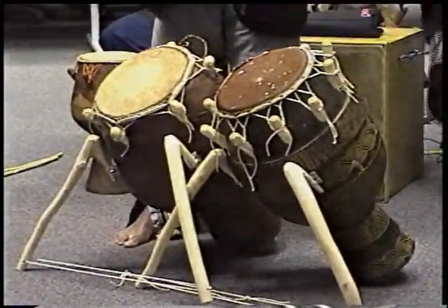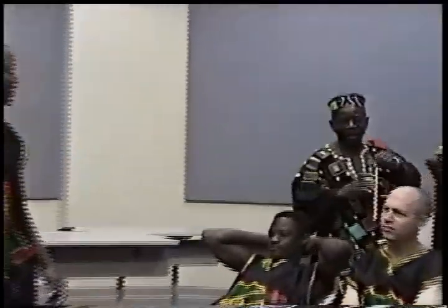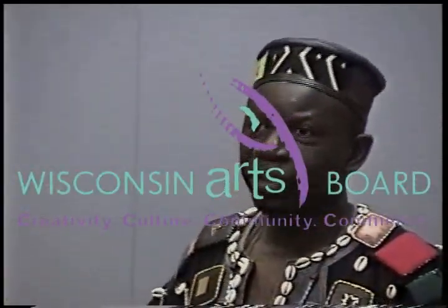This one is really round. When I'm carving them, I use green logs. So first, when I finish getting the shape I want, I use recycled newspapers, wrap it round, and then put it in a plastic disposable bag, tie it for one week, and the moisture transfers into the newspaper from the wood.